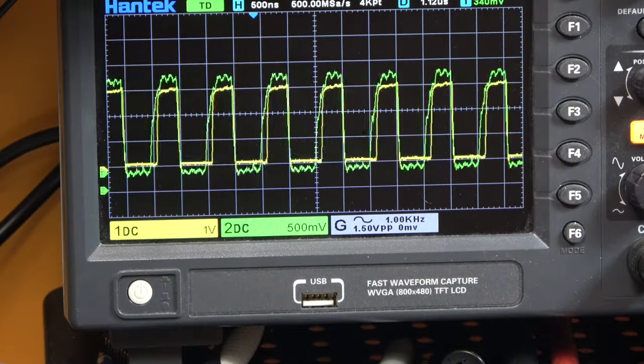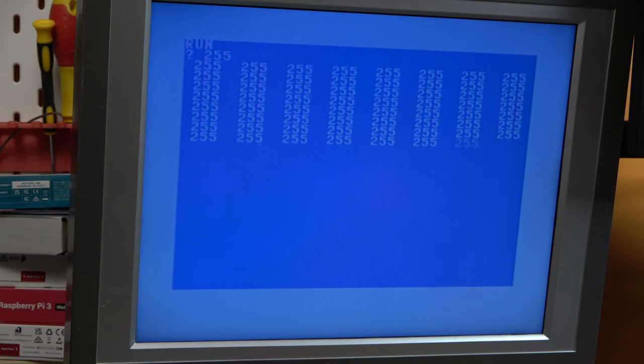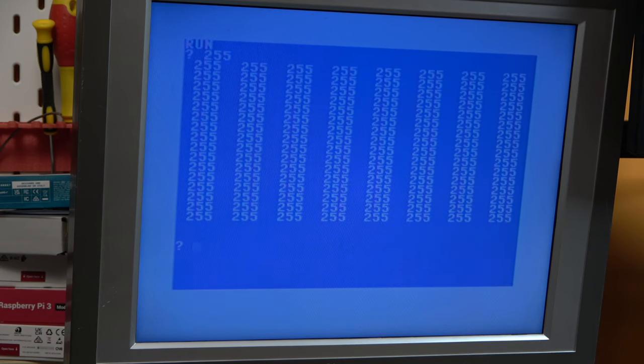So I will run you through some numbers. Let's go onto the screen. This is our usual little program that is calling a piece of machine code that writes the number that is input into the SRAM and then reads it out. So before we did 255 and that worked fine, but when we went to low values, let's say 0, it didn't work fine.